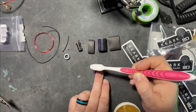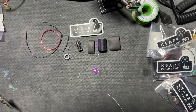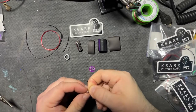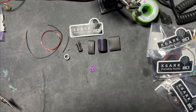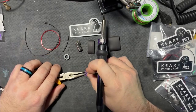I'm going to put a little flux on the pad there, turn our soldering iron on, let it heat up, and then we'll put a dab of solder on that board. I am nervous about this part — I have put my smallest soldering tip on. The capacitor comes in this little plastic case with a little film over it. It is like a grain of salt. I am going to need some tweezers — my unsteady hands need to handle this. That is really small.